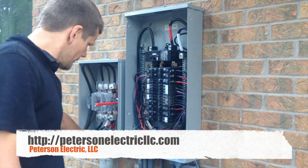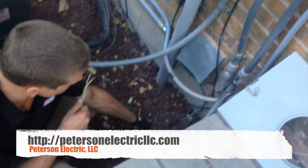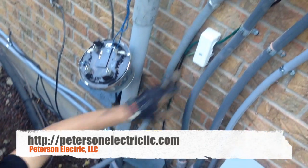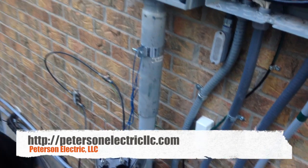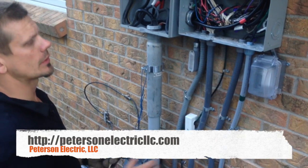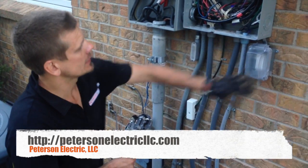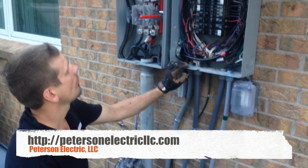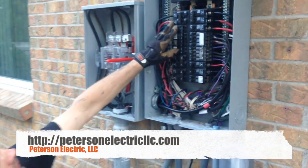We were able to fit all our grounding in here. Here's our grounding — you've got two ground rods that we ran, here's our grounding bridge, and our Comcast line coming from here, grounding to here. We installed an outlet, which in commercial is now required at every service. We did it here just because they asked us, but it does have a heavy-duty weatherproof GFCI cover.